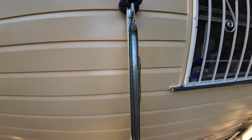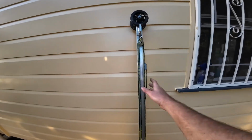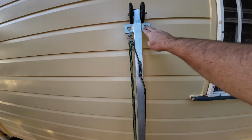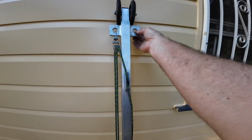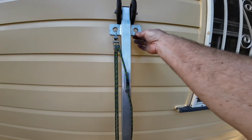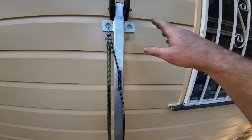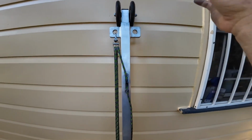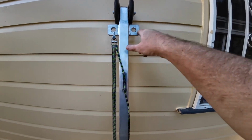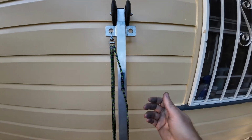If the mast doesn't stand well, we sometimes have these lines secured here. There's two on each side, one forward, one backwards, both go down to the tow rail. So two lines either side, forward, aft, tow rail, nice and tight, with nice strong secure knots.